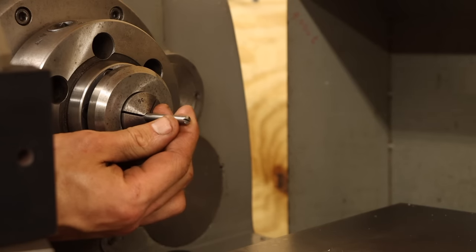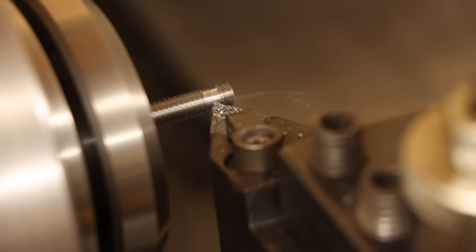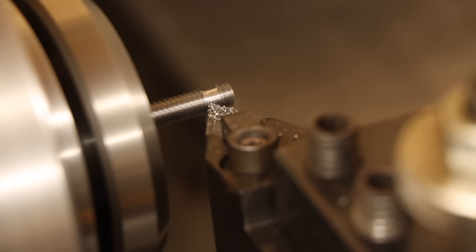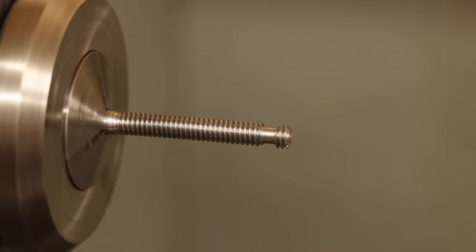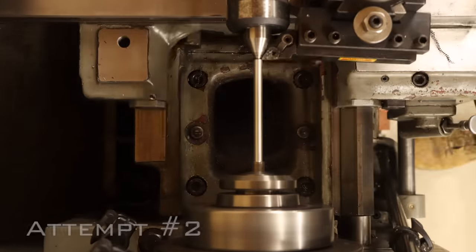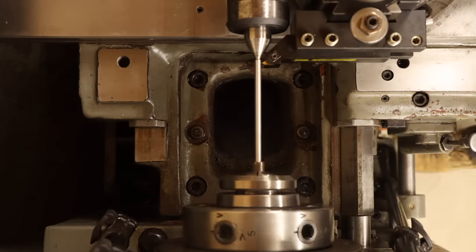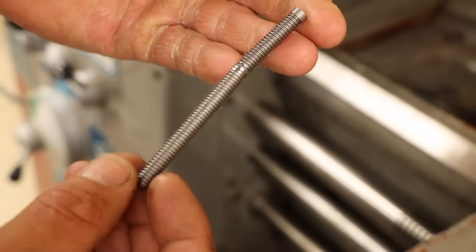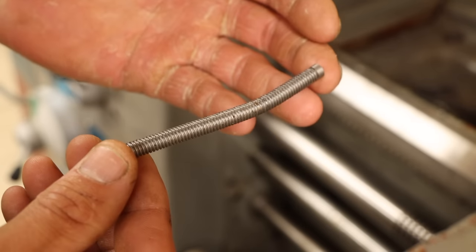The runout on the blade had me a little concerned, but the slit seems to have come out just fine. Back on the lathe to cut the threads. I'm only partially threading this now while I have a short stick out. This will let me turn down a detail for a locking set screw I'll make later. After doing this to both ends, I can finish cutting the threads for the longer screw. Those threads didn't come out even remotely straight, and of course this jams up about halfway into the block. I'll just start over and single point turn the threads first. I might have been a little overambitious with the depth of cut — let's try that one more time with lighter passes.